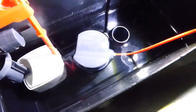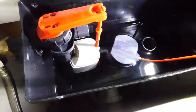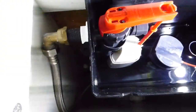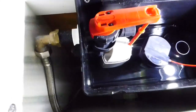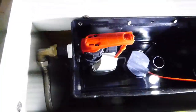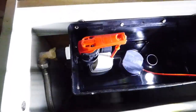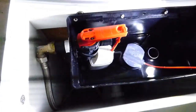What I'm going to do, because this has been happening a couple of times and it's caught me out, I'm going to fit a little valve on the top of here - a little isolation valve. I don't normally like them, but they're very small and they do fit in. So I'm going to show you how to get one squeezed in there. If we can slow that flow rate down, then we'll find that because it's going in slower than it's flushing, you won't get that running on like it's been doing.